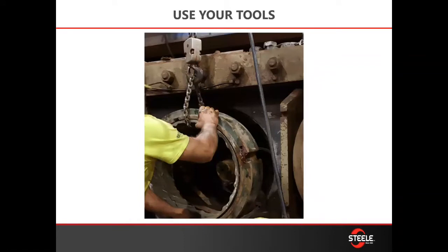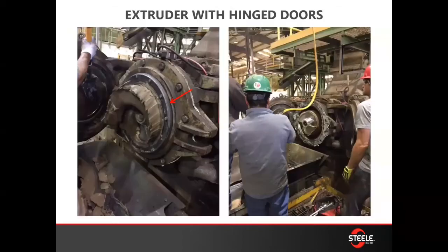With the chain positioned like this, a person is going to have a tough time maneuvering the adapter and liners to get it back on the keyway. Using the barrel adapter tools extends the keys out past the barrel, which will help. Also using the eye-bolt to safely lift it up helps keep your fingers out of the way.